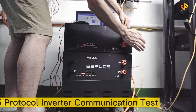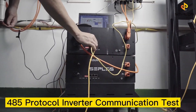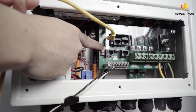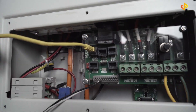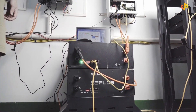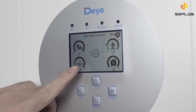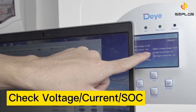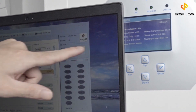The following test is communication with the inverter. The V16 BMS is designed to be compatible with both the 485 protocol and the CAN protocol. We will start with the 485 protocol communication test. Now compare the parameters from the BMS with the inverter.